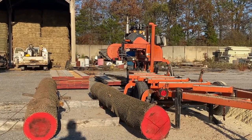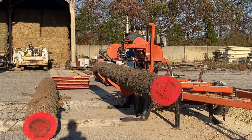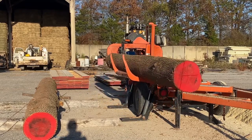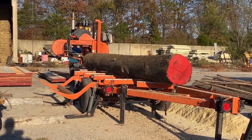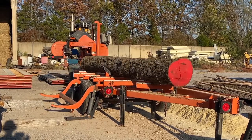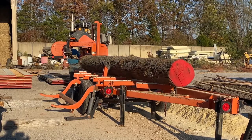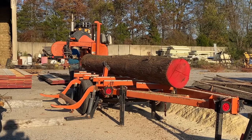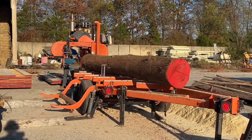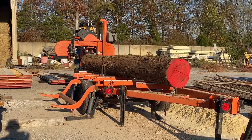Let's take a look at what's happening now with Mr. Pete's log pile — he's getting ready to mill those logs into boards. See the arm lift the log up onto the platform and lower back down. Then another arm comes up from underneath to turn and rotate the log until he's got it in just the right position to make his first cut. He's using a portable bandsaw with a blade that will slice through the logs.